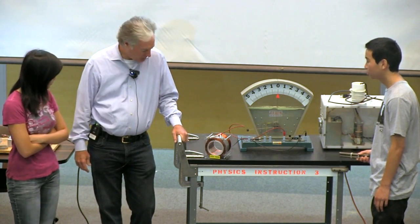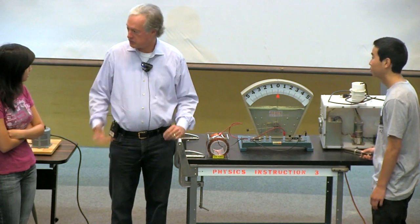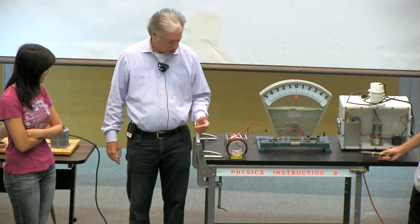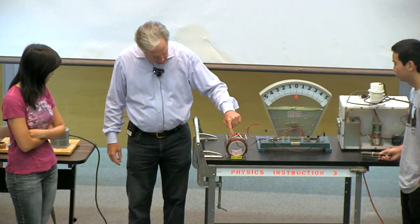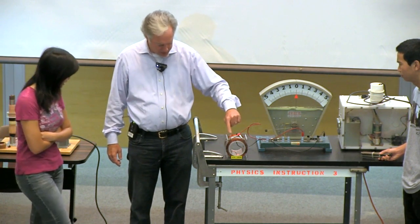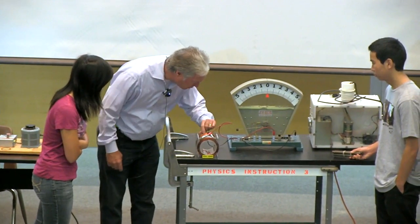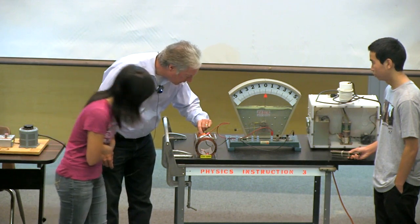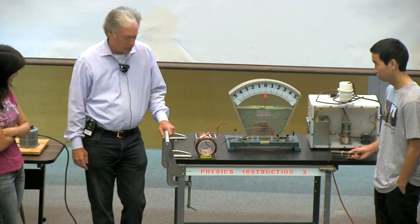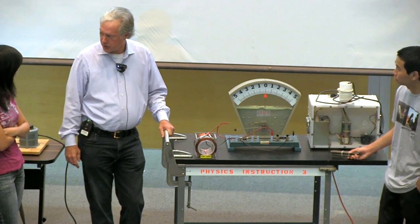There's a label. Now, that's a quick assessment, right? That there's 3,250. But what do we say in physics? Trust no one, right? Let's do a measurement and take a look. How far across, what's the diameter of each of the wires? I'm seeing a diameter, it looks to me like about 0.5 millimeter, so 500 microns for the diameter.